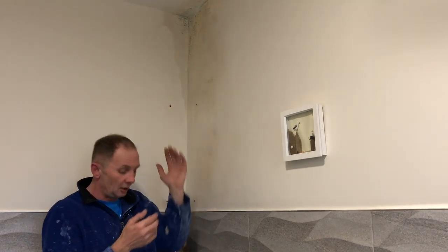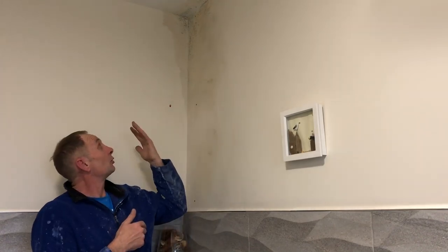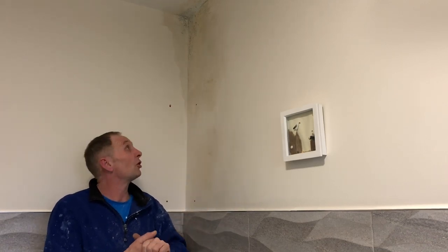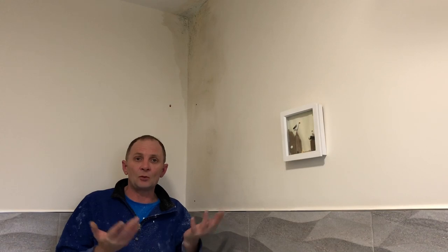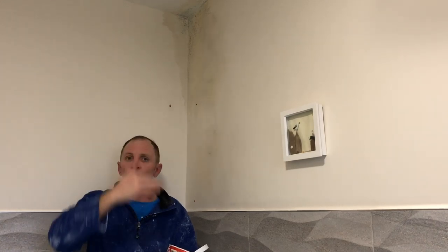In this video I'm going to tell you the procedure I take to get this sorted out. First, I've got to let this fully dry out - probably get a heater on there to dry it out quicker - and wipe over the surrounding area with a rag with bleach and water to kill the mold. Then what we're going to do is seal it up, because when you've got a water stain on a white ceiling or even walls, you can't just emulsion over it because the stain will come straight through.